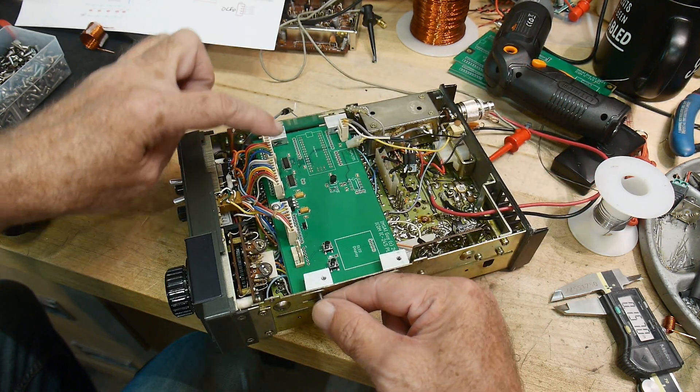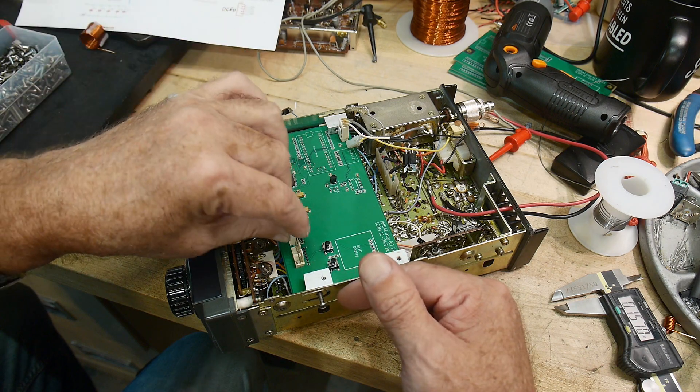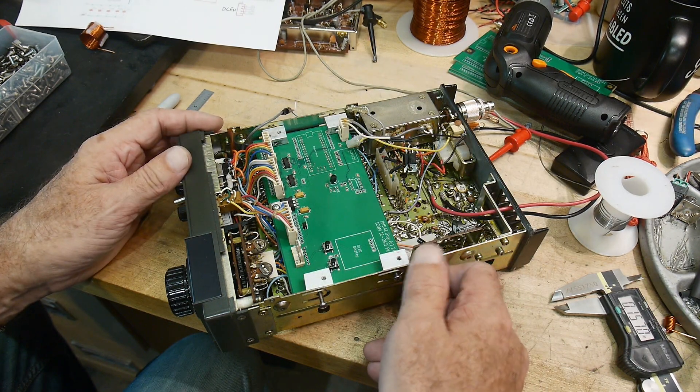All I have in here is the shift registers and the 5-volt regulator. I wanted to try the 5-volt regulator and make sure I picked up the right pin. I fed 13 volts to the regulator and I'm getting 5 volts out.